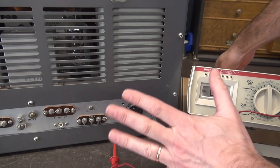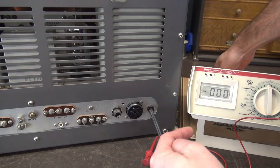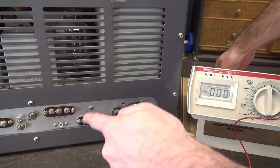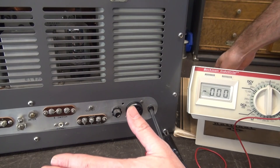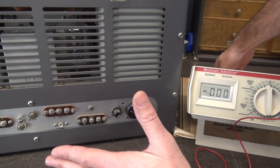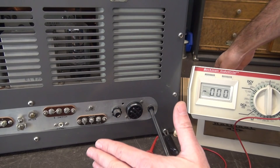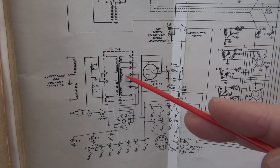What happened, I guess, is this guy had done some work. He was pushing his radio back into position and he had some ground runners back there that fed all of his radios. What hit the terminal? Ker-pow! And the biggest issue is not only a safety hazard, but it can damage the radio because this high voltage is not fused.